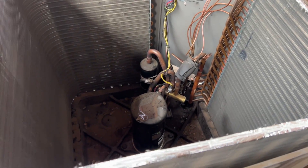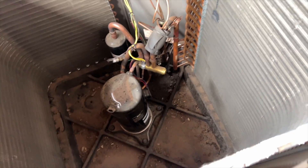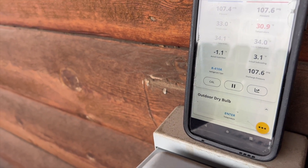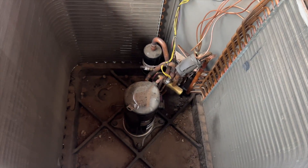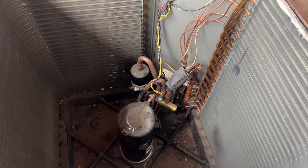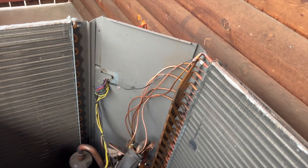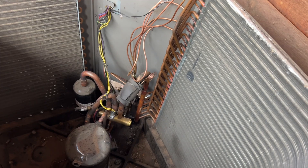We got the top off. I've checked all the little cap tubes and they don't seem to be leaking. Our refrigerant charge seems to be okay - currently off, sitting at 107.4 PSI. It's 410A and it's about 34 degrees outside, so saturation is right about there. The charge is okay. I'm guessing this TXV right here is the one that got changed, considering the tubes look all new.